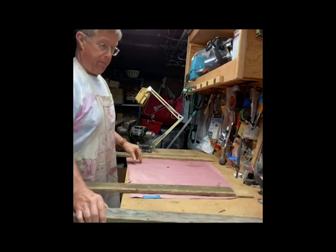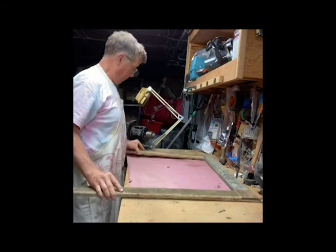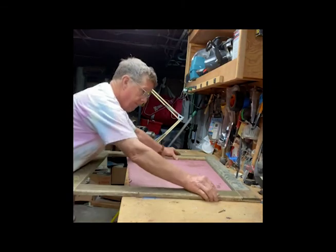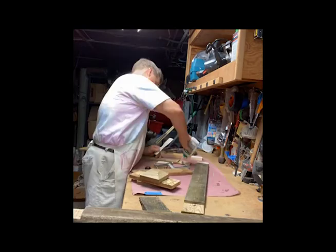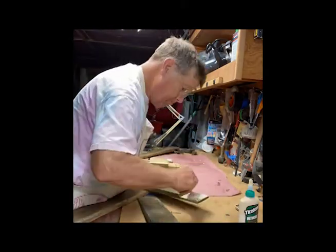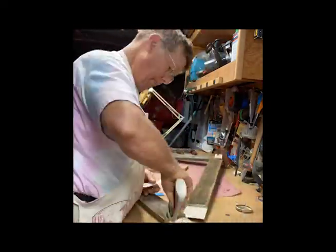And then we could lay these out exactly as planned, a little bit of sanding, a little bit of adjustment, and everything worked. So with the boards fitted and the joints cut, we were all set to glue the 4 corners together. That involved applying glue smoothly to each side and then clamping it.